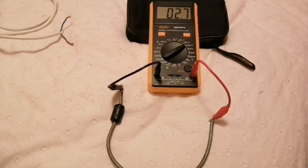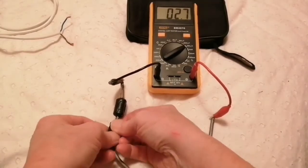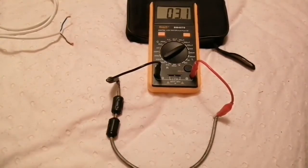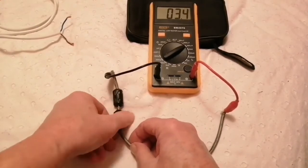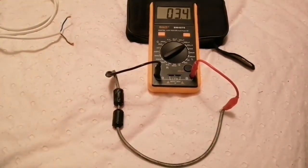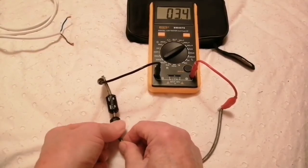Let's go ahead and add another one and see what effect that has. Remember it was 2.7 — it's now gone up to 3.4. So that's gone up 0.7. The first one brought it up about 0.5 and the second one brought it up about 0.7, so we can say roughly about 0.6 on average per ferrite. These are the ones that clamp quite tight — they're actually quite tight.